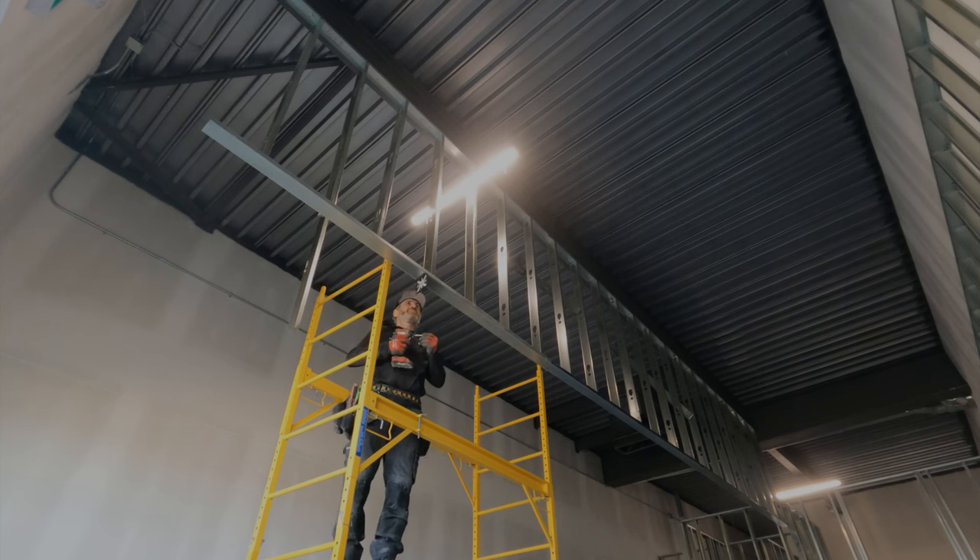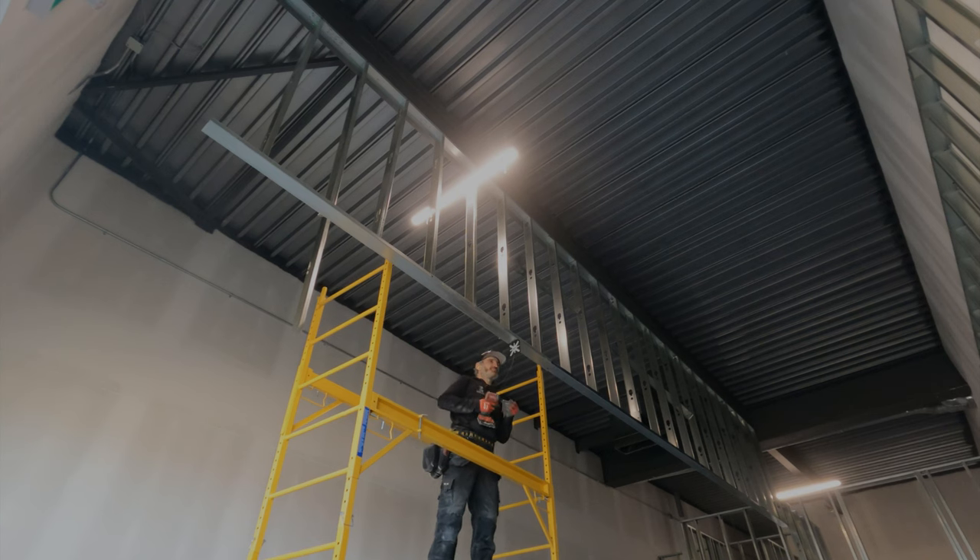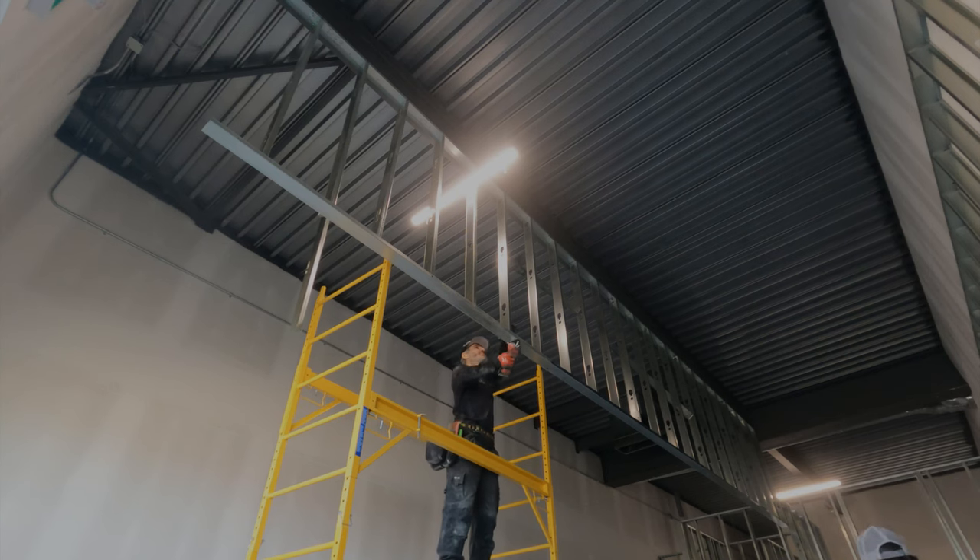It's so easy. If you put your line laser right at elevation when you're doing your track, it's gonna be tough because you're not always gonna be able to see it, and you're kind of limited on what side you can shoot it on. So doing a two-inch offset gives you a clean run and you can square both sides. You see him — he's just using his hand with gloves to pinch it and hold it at elevation. He screws it in and it's perfect. If you can't do that, just use a clamp.